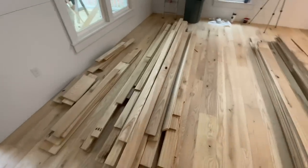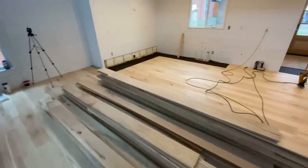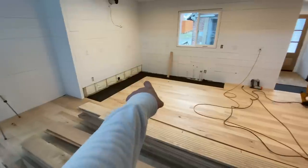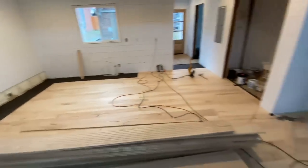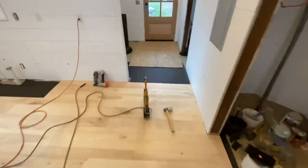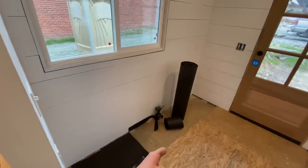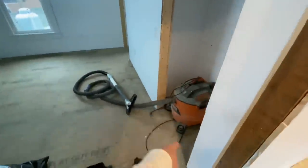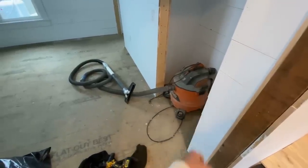We put down quite a bit of material and I know it's going to be super tight as far as having enough. That's the reason why we omitted the flooring under the kitchen cabinets - we need to save as many boards as possible. We also left out this closet and put a threshold piece so the closet could be done separately. There's going to be a bench seat here about 18 inches out, so we're going to skip that area and save material. We have to do this whole bedroom still. In the case that I don't have enough of this kind of wood...